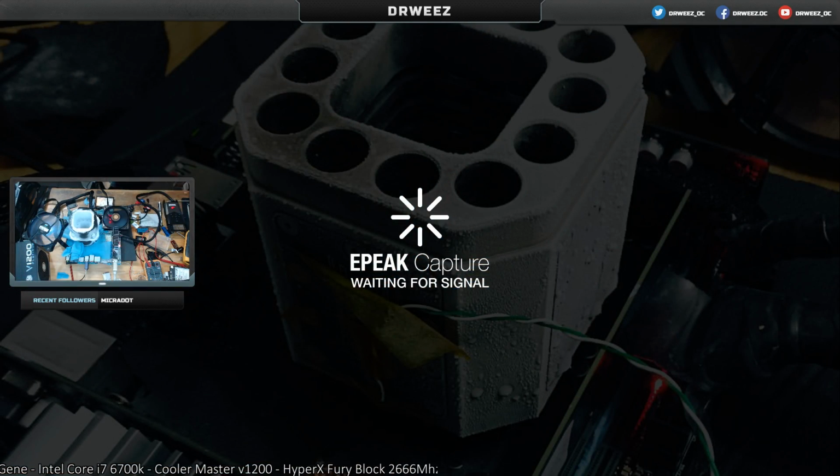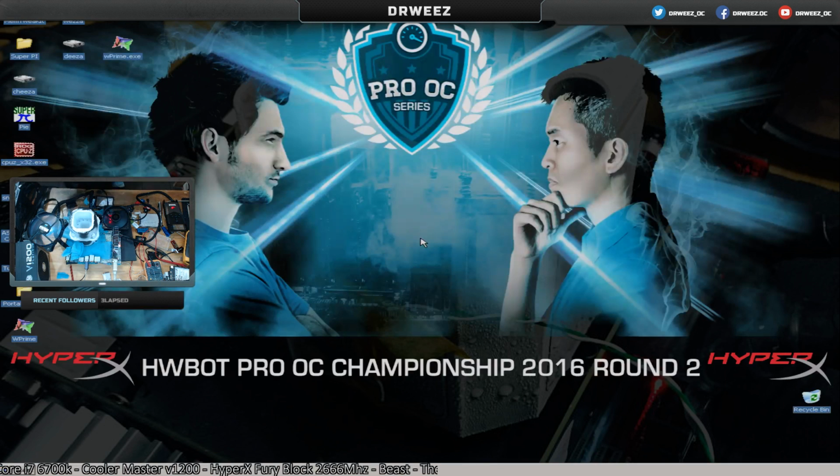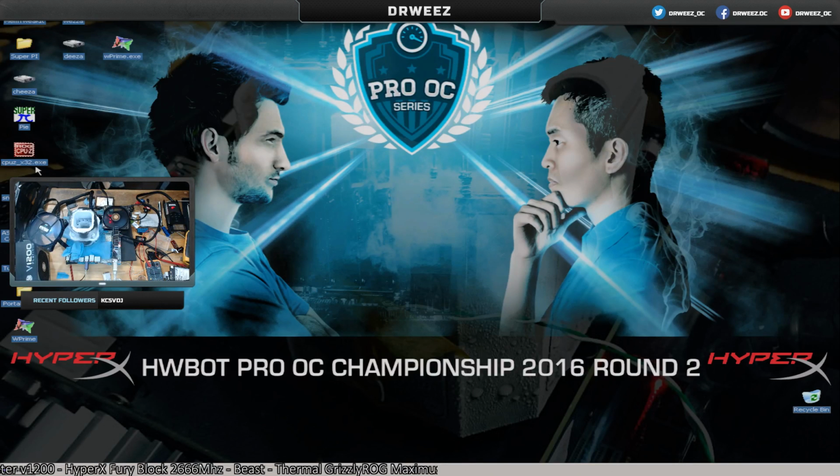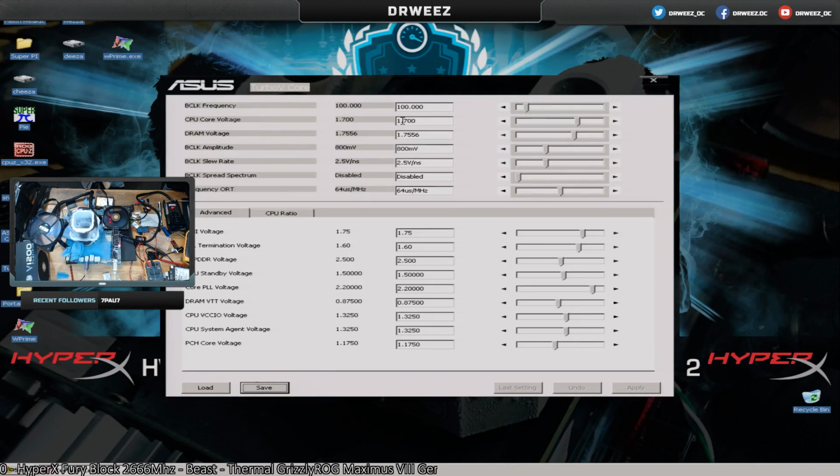Right, so we're back up and running. We're back into Windows now. I've learned I can just restart the VGA splitter and Bob's your uncle, things come back to life. Right, so we're going to try and do that 6.4 first run again. I need to be a little bit more careful with the pot. This chip can cold bug. 188, 185 on my multimeter, so we need to make sure that we are thereabouts